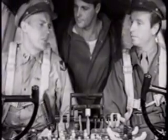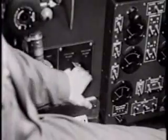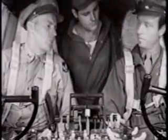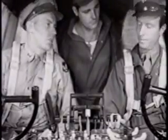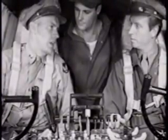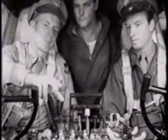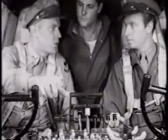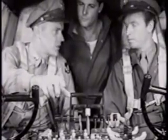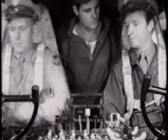Before we start number 2 engine, set your vacuum selector switch there to left. We want the vacuum pump to start delivering just as soon as number 2 engine starts, so we can see whether the pump is working okay, and also to see whether the flight indicator is functioning properly. The horizon should snap into position firmly and quickly just as soon as the number 2 engine starts. All right, let's start her. From here on, it's just like number 1.